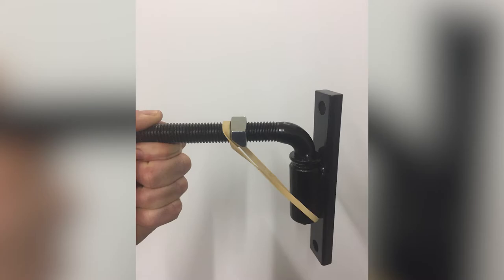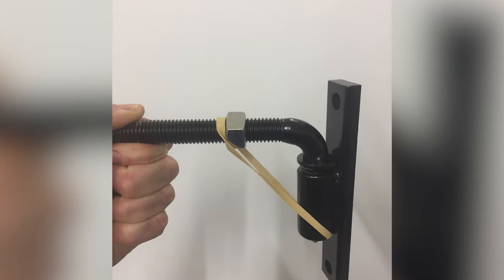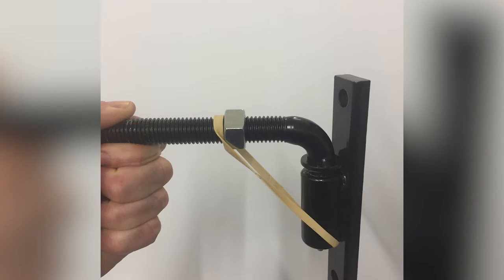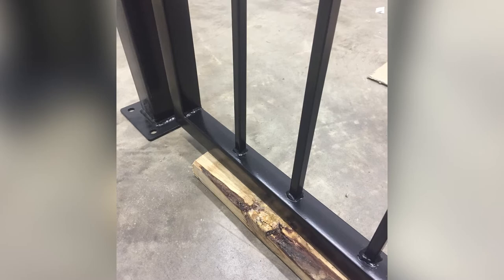Here's a little install trick. Now that you have your gate frame drilled for the upper and lower J-Bolts and loosely attached to the frame, we need to put the J-Bolt portion into the backing plate so we can mark the holes on your post. The only problem is that the backing plate will fall off the J-Bolt, so combine the two pieces and then put a thick rubber band on to hold them together. You may need more than one rubber band for the bigger 7-inch J-Bolt hinge. Before you lift the gate up to the post, get your wood spacer for under the gate. Set your gate on that so you aren't trying to hold and balance the gate in the air. This is the last chance to set how high your gate will sit off the ground — make sure it won't impact the driveway, sidewalk, or grass when the gate is fully opened. With your wood spacer ready, install your J-Bolt to the gate frame with your backing plate rubber-banded on, put the gate between your posts, and set it on your wood spacer.